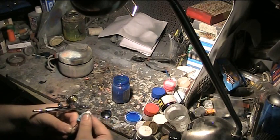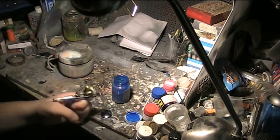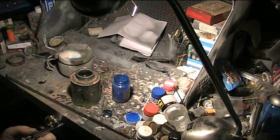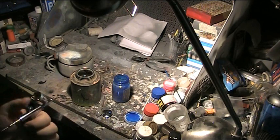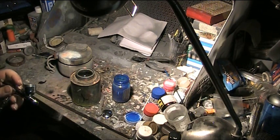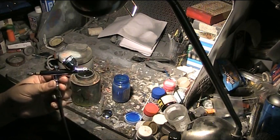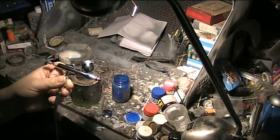Having a very neat and clean airbrush is worth it — just having a tool that's well maintained is very easy to work with. In cleaning out my airbrush I noticed the tiniest bit of blue has seeped into the rear of it. I put a lot of grease in it so it hasn't travelled far at all — probably a tiny trace just before the trigger. It doesn't feel sticky or messed up because the washers are definitely dead. It's just a reminder that lubrication is very important, especially for older airbrushes that would normally be deemed unusable — this really old defunct airbrush with the nickel plating removed is producing really nice work.